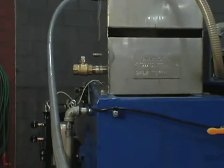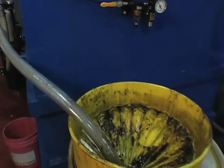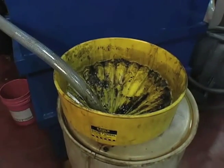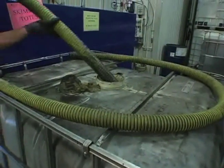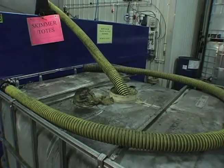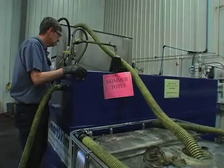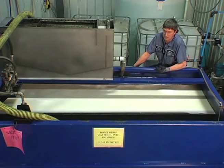Look around this shop — you don't see any smoke in the plant. The oil that creates the smoke is in here, and it's coming out right over there, and we're now going to sell it by the drum. They buy that oil because I'm able to remove all the coolant from the oil, so I'm no longer paying out any money to get rid of coolant or my tramp oils. We save approximately $15,000 a year just in our coolant purchase alone.